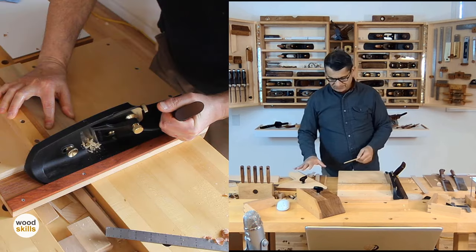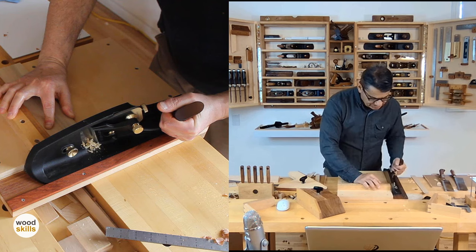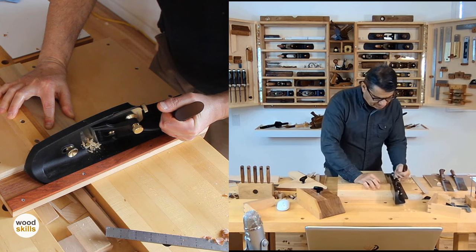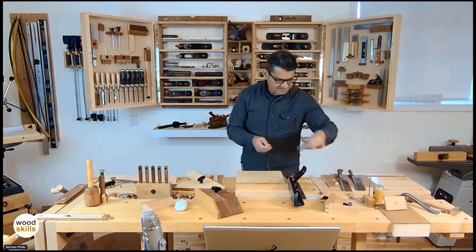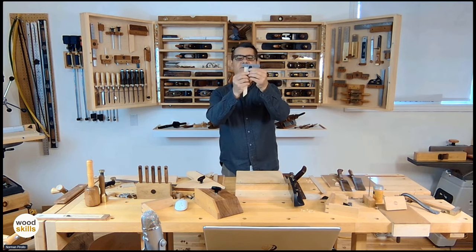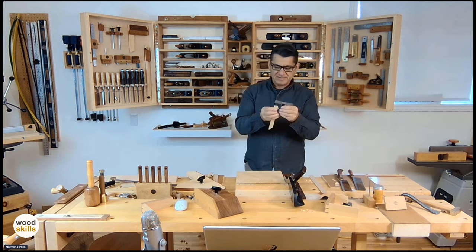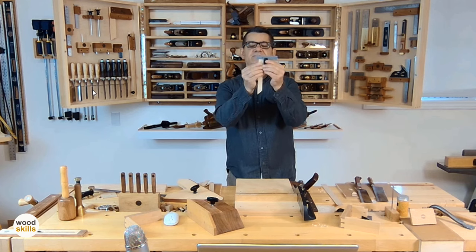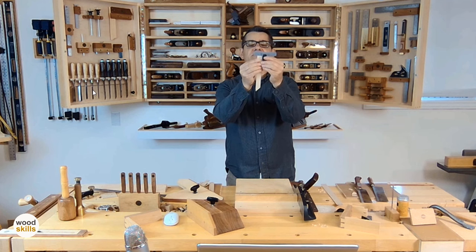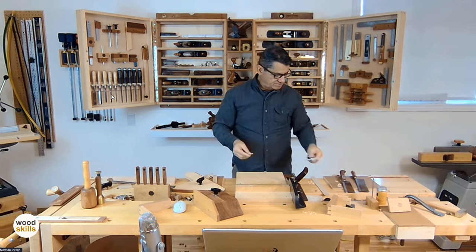When I'm not doing face or case miters, I'm doing 90-degree clean edges — that's the beauty of this. So that's a perfect 90 degrees. A little tip for measuring for square or a specific angle: don't hold the gauge tight against the wood, because it's very easy not to see the gaps. Keep it away just enough, and then try to determine if the gap is uniform from one end to the other. If you have it too close, it masks the ridges and the valleys.